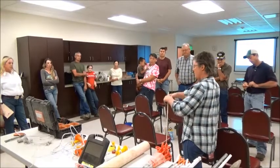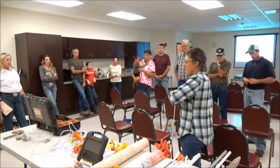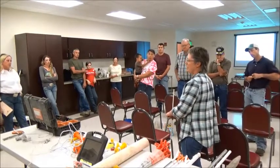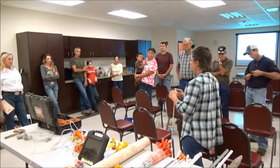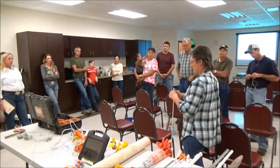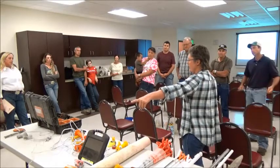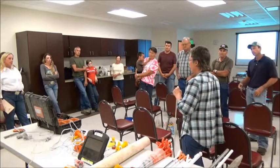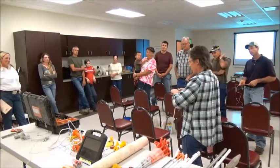And then the other thing is that you just want to, in your heart, you want to put that insulator down here. So the cow won't jump over it. Or the cow won't slide under it. If your fence is hot and the cow's touched it ever, she will not go under it. Unless it's 20 below, there's a stackyard full of hay over here and a bunch of hungry cows over here. And what they really do is they pick the weak cow and they push her through it. And that's how they get through the fence.